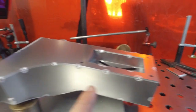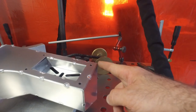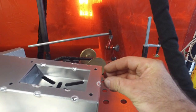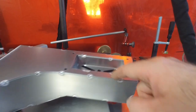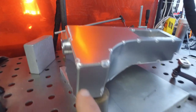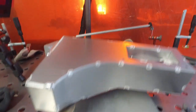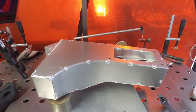Now I'm going to weld this catch can. Obviously this is the top of the can. I'm going to actually be starting from this corner and working my way around the can, so my start stop is in the back corner, and there'll actually be a fitting that'll go on here and ultimately cover that start stop. Things we have to be aware of is the thin material around this filter basket and some fitment issues that we have with these double folds with this rolled edge on these products. So let's get set up and start plowing through this welding.